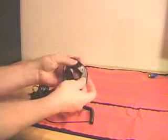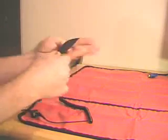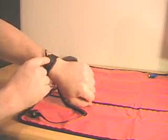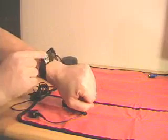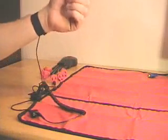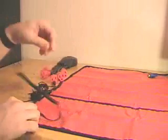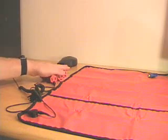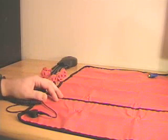To ground myself, I'll use this wrist strap and plug that into the grounding mat. The wrist strap has a little metal contact, so when I put this onto my wrist it makes contact with my skin. I want to make sure that this is tight enough that as I'm moving around, that metal contact point is always in contact with my skin. So now as I'm connected to the wrist strap and the wrist strap is connected to the mat, the grounding cable, and the surge protector, ultimately that goes down to a grounded outlet which is grounded to earth ground. This is one way to ground yourself before you work on components.